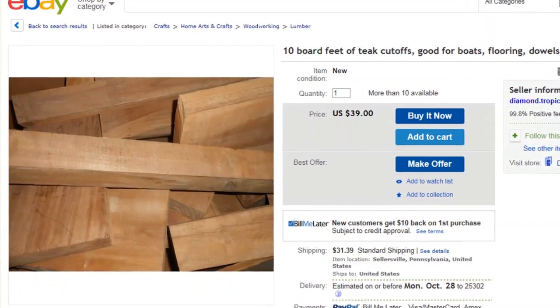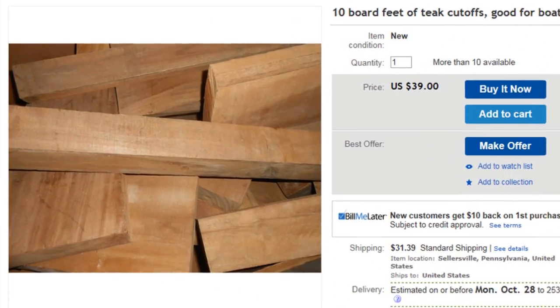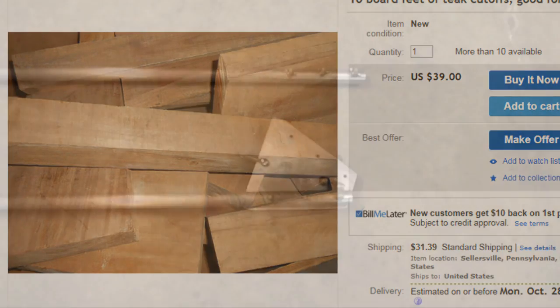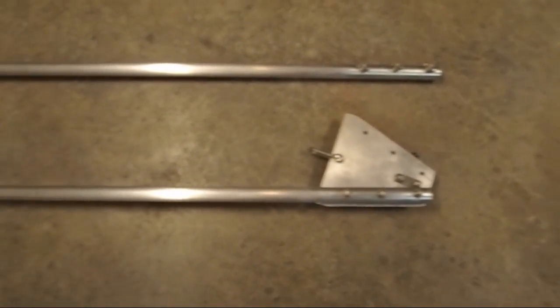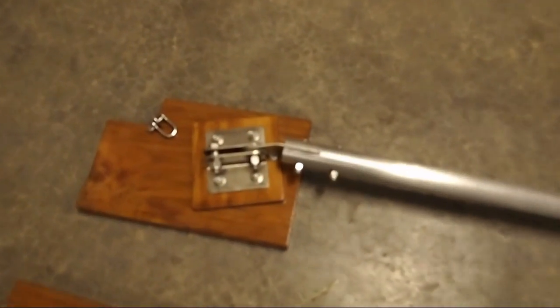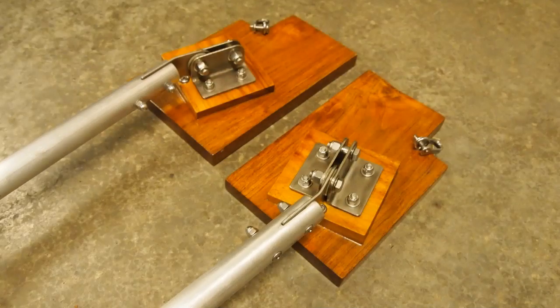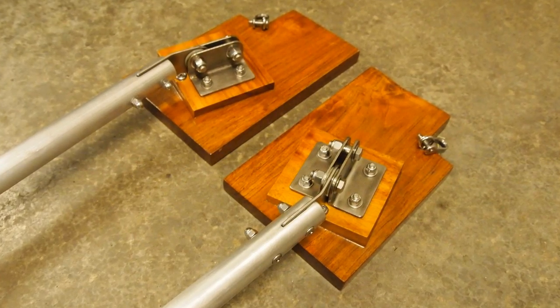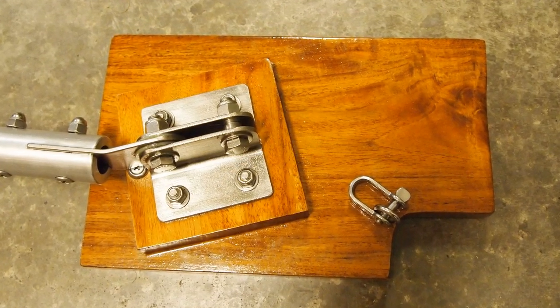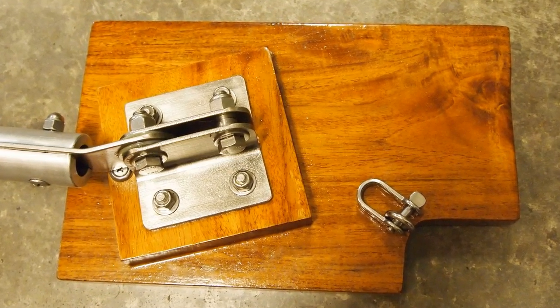My hinges are made with stainless steel angle and plate, and the base plates are teak. This is the final product laid out on my garage floor. The base plates and the hinges are the fiddly part, because they have to conform to the angles of the boat's deck, and they have to align each leg's hinge axis so that the assembled A-frame swings straight fore and aft.